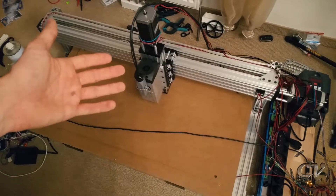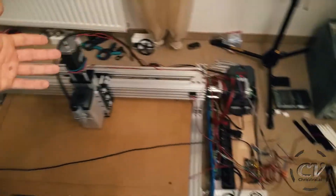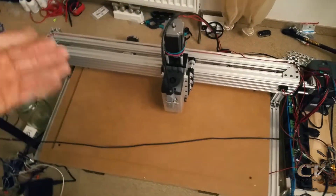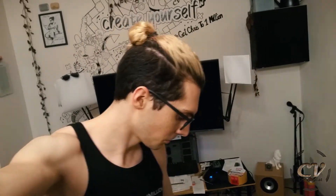This just speeds up everything. You can draw lines, mount your material in the same spot every time, and just know what will happen. But until I exchange these unshielded cables with shielded cables, I need to set my home point manually — jog around and then set the home. Shouldn't be too hard. It's just so sad. Well, I didn't know better, but I could have done a bit more research. Anyways, it's a never-ending story.